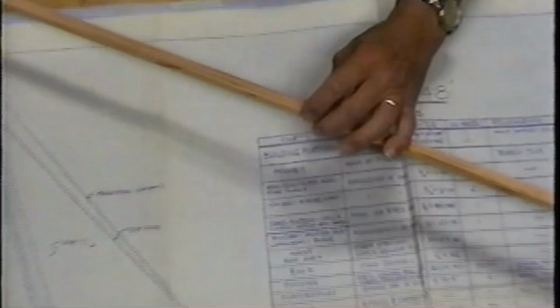Real well indeed. We also needed members for the sides of the boat that would bow around, if you can imagine, for the sides, the way the boat would be shaped like that. And we ripped that out of the same board, the same materials, and that's 1/4 inch thick by a little over 1/2 inch, about 5/8 in that neighborhood.